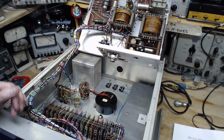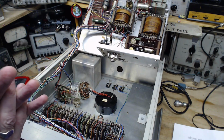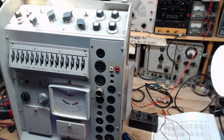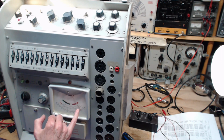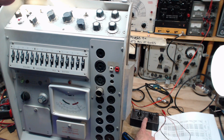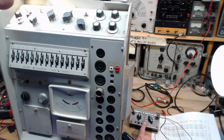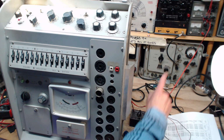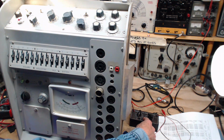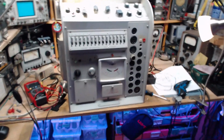I need like a really gentle supply of electricity to do that. How about something with a big resistor? That might be the way to go. Okay, I'm going to get ready to test the meter on this guy. Okay, I think I got things set up. Now you can see the meter is up a little bit. That's just gravity pulling it forward. So that's its 0 point right at the moment. I have this decade box. I've set it to 1 million ohms. I think 10,000 times 1,000. 10 million ohms to start with. I have a power supply I can set very low to start with. Everything low, and we'll see if anything will move this meter. So with the big resistor here, I think I've protected the meter. Now I'm going to end up stepping right in front here. I'm afraid what's going to happen.